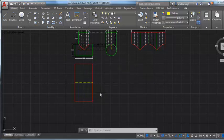So I think I'll show you the way I'm going to develop this. If this thing rolls back up again, there'll be kind of weld seams there if it was apart. It doesn't really matter if it's paper, but I'm going to treat this line that I just did as 12 o'clock in this picture here. So it's going to be like top dead center in that right side view. And that'll mean my branch is going to come right in here.